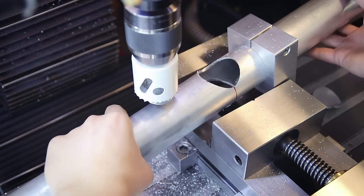Back at the welding table I can check the fit for these miters — looking good — so I set up another little contraption at the bottom to clamp and align these to the frame. It's just another piece of extrusion and some sheet metal to get the surface to the right height, so I can clamp two blocks onto it and have the miters match up with the down tube. All the fixtures are set up now and this is almost ready to weld. I just need to do one more thing before I start: drill some vent holes. I'm marking the positions where the tubes intersect and then drilling some small holes.